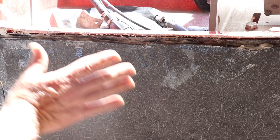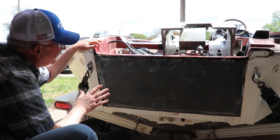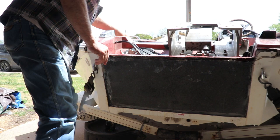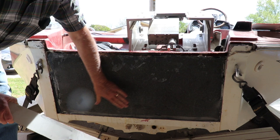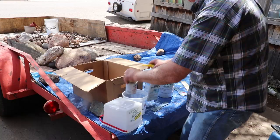When we get the 1708 on there, we'll set it in and let it just get tacky. It's 85 degrees right now so it won't take long. We're using the fast hardener with our West System, so it won't take very long. Then we'll take the pieces of fiberglass that came off — it's the small piece we had to cut in two pieces if you remember — and we'll begin putting those on and getting it all glued up together.